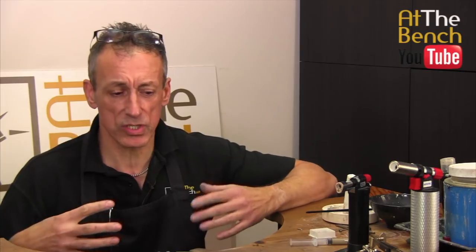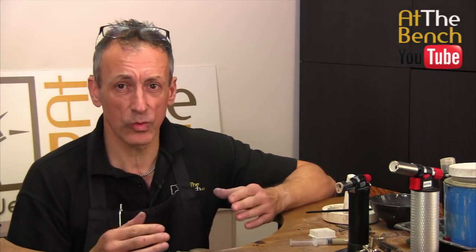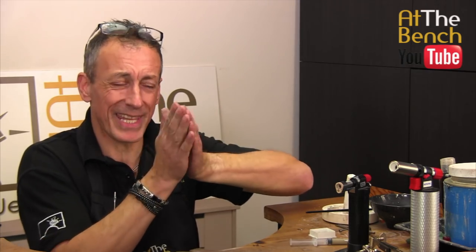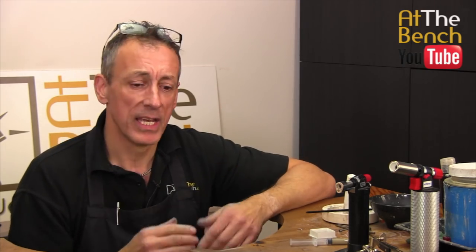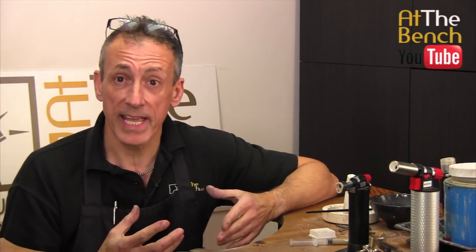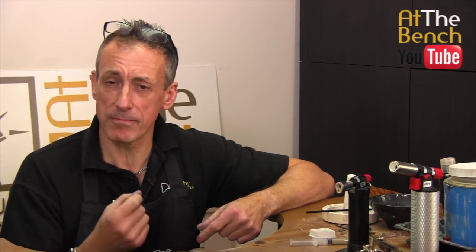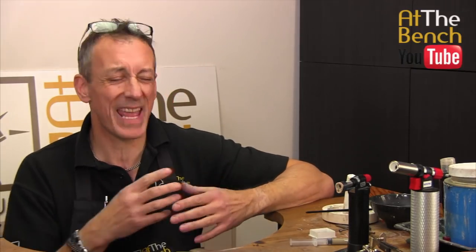And you see me do some films where we solder sort of indirectly. We don't even really let the flame touch the item, the piece that we're soldering itself. We use the heat that comes on the outside of that flame to heat the job. So why do we do that? Well, it's because sometimes if we put that cone, that tip, right on the jump ring that we're soldering, it's going to be too hot. And it's likely that that bit of metal is going to melt. And that's no good. That's no good for anybody.